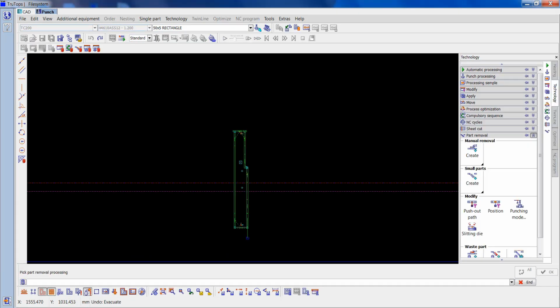Just wanted to interrupt this part of the video and explain why I shortened the push out. Shortening the push out is not necessary, but it just saves time on an operation that you do not need. Because when you add the code and turn the suction off, the component literally just falls down the chute. So a long push out is definitely not needed.